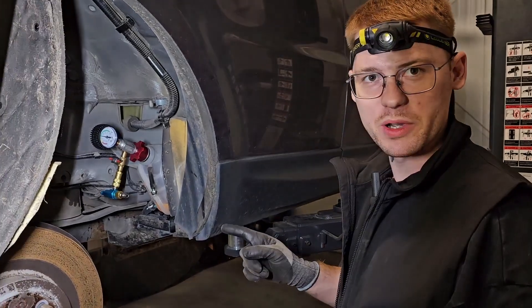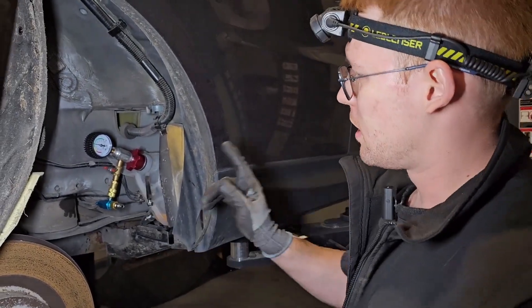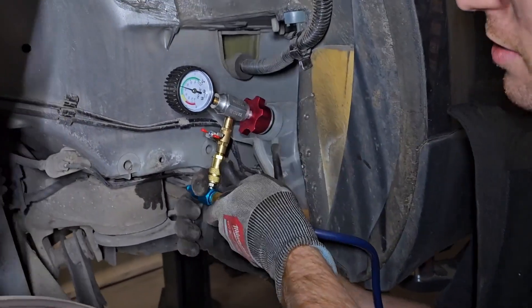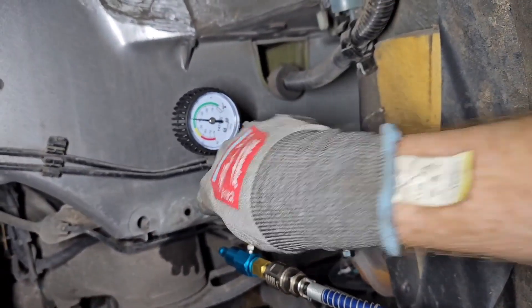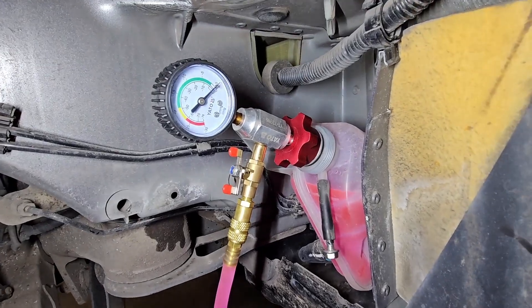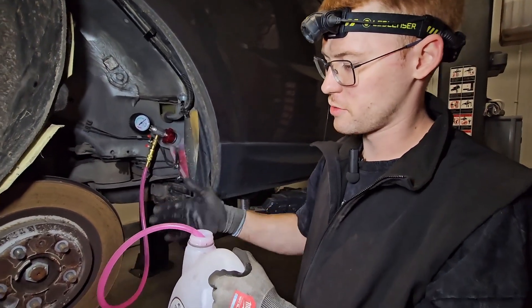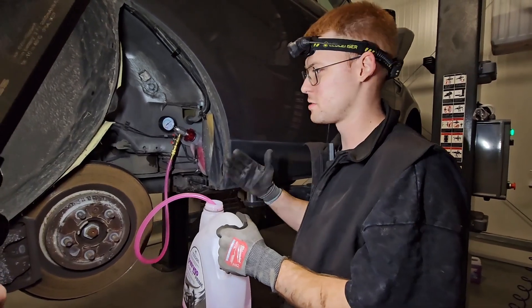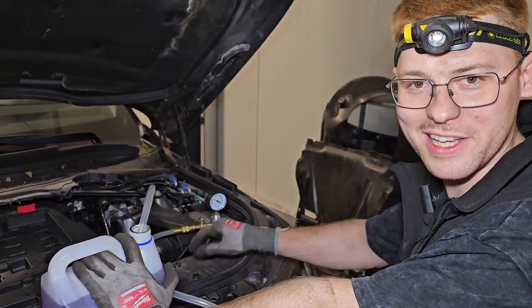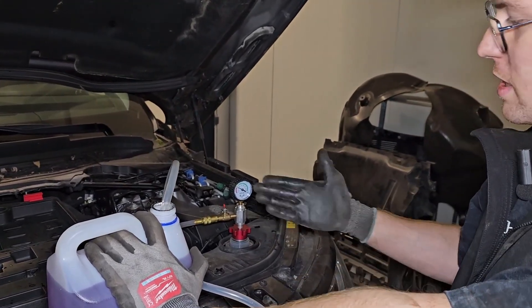After repairing the battery we also need to replace and refill coolant for the battery. We're using this vacuum kit — you just connect the air. Use this assembly for refilling your coolant for the battery. It's very fast and you'll be sure that there's no air inside your battery and cooling system. It's very important. In the inverter, converter assembly and electric engine we have this system coolant and also replace it by vacuum.